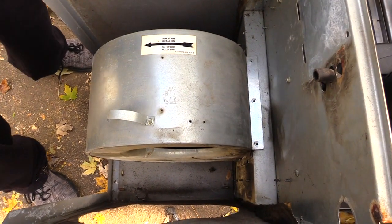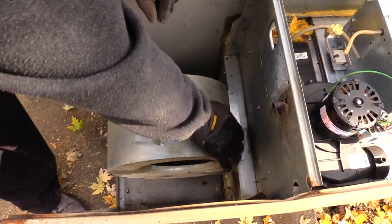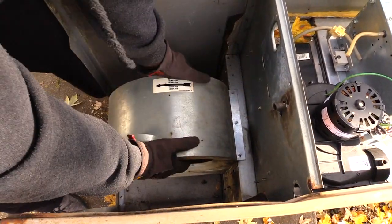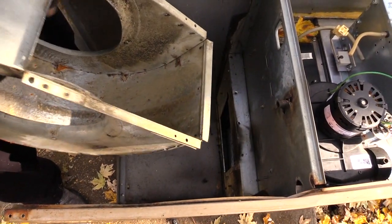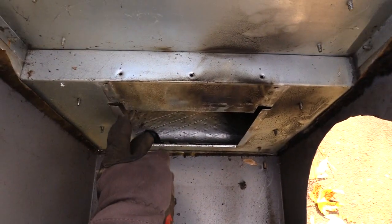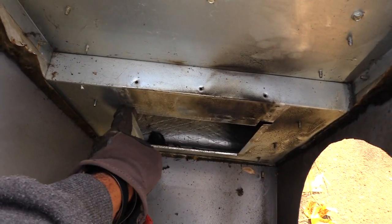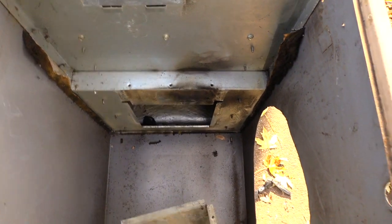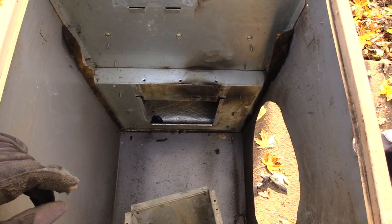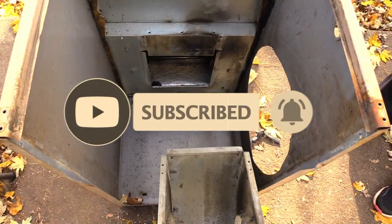So once again, this is how you would be removing your blower motor from out of your furnace. You take the screws — two on the side and a few in the front — remove your control board, then slide it in. Make sure you slide it in behind those two little lips so it sets itself up properly. Alright folks, this is how you'll be changing your blower motor on your furnace just in case it goes bad. Please check out our other helpful videos, please like, subscribe, and share. Thanks.